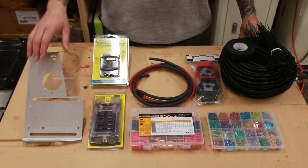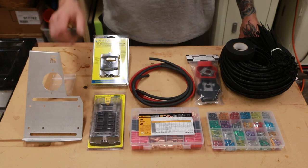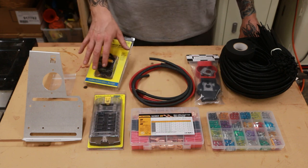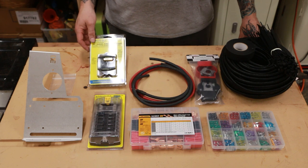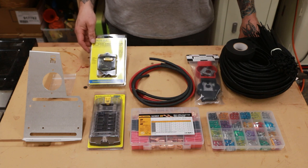The bracket is designed to hold either a 12 fuse block or a 6 fuse block from Blue Sea Systems. The fuse block I'm going with is the 12 fuse version. We'll also need a circuit breaker to protect our new fuse block and the accessories we'll be plugging into the auxiliary panel. When selecting your circuit breaker, add up your proposed amperage of all your accessories to come up with the desired amperage you will want for your breaker.